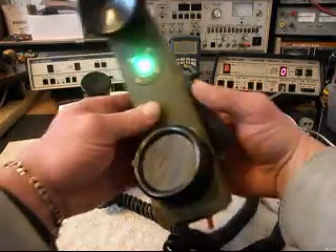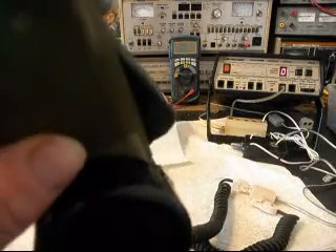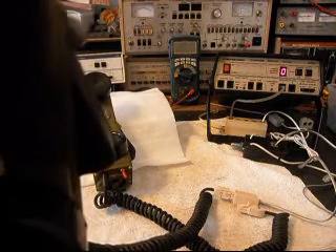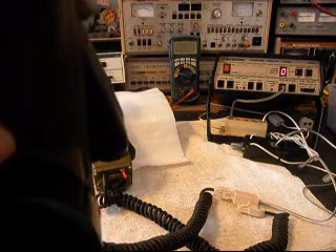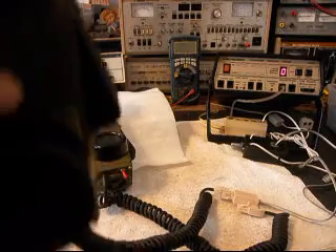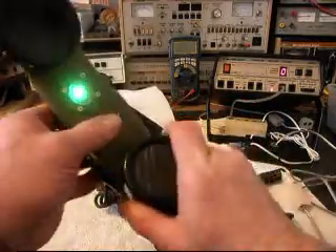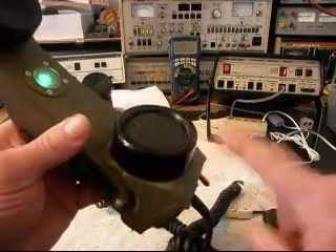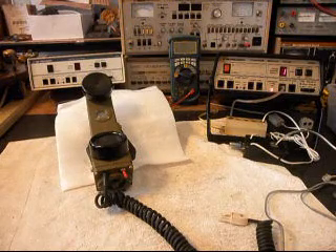We'll reactivate it. I'm going to take a tone dialer and call a time and temp number. The call connects and we hear: Good afternoon, Offenburg Ford, still big in Belleville for nearly 70-plus years, call 234-0330. Today is Tuesday, January 28th. The time is 1:04, current temperature 25 degrees. Very cold today, mostly sunny skies, highs around 17, mostly clear this evening, lows around 9. Sunny on Wednesday, highs in the lower 30s. Now I want to put the switch box back over to the analyzer and give you some dial tone. I want to cause dial tone to go away — I want to transmit into the handset. If you watch that red light on the analyzer, every time you see that red light, that's an indication of 100% modulation on transmit.